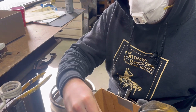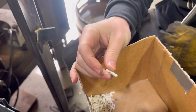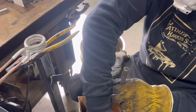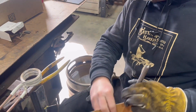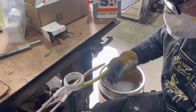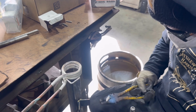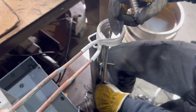That is 3/32 flux-coated braze rod that we chopped up from three-foot sticks into very tiny pieces. And you're putting how many down there? Putting two per baluster. And then he's come up with a way of regulating the heat between the thicker baluster and the lag, as you can see. And we have this jig that keeps everything aligned and straight.